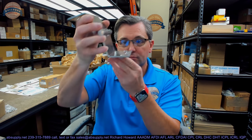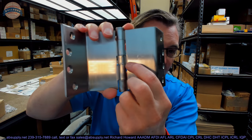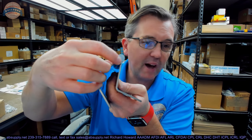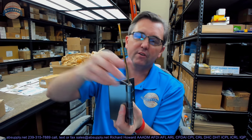The telltale sign is always what does that leaf look like — is it very flat all the way across? Is there milling run-out at the very end? In the crotch of the hinge barrel, have they finished it very well? You can see there's a difference in how the light is reflected because they can't get the tool in there to brush it, but they do a good job exerting effort to make it look finished. Not every manufacturer is so good at doing that. This has a button tip on it — looks like the button on your shirt or coat. It has a hole down here which means you can drive that pin out. In fact, the Stanley hinge includes such a tool, and there's a link that shows you how to drive that out.